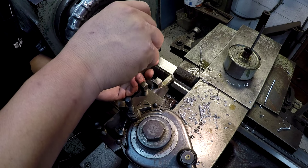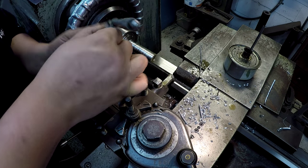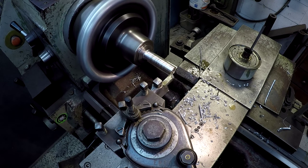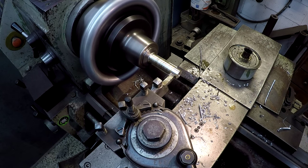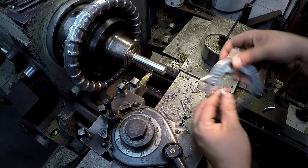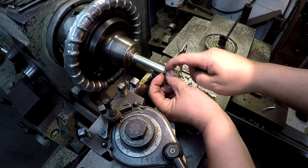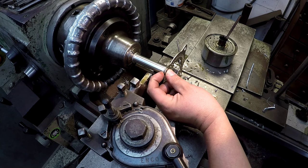That's leaving a pretty good finish — we'll hit it with some Scotch-Brite. We've got about 5 thousandths left, so we'll just take 5. That's not a critical diameter there, just as long as it matches up good. The spacers will actually be fitting on that shoulder. I think that looks good — real close to that radius right there. I think that's it — 20 mil. We're going to leave it at that.